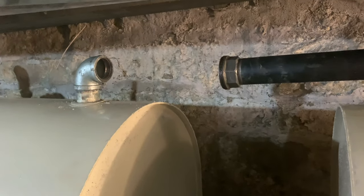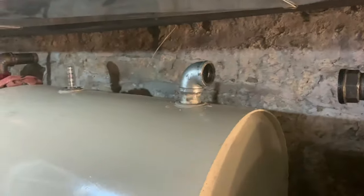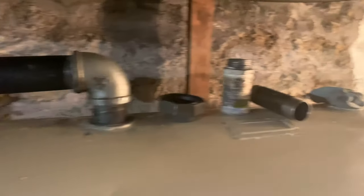Crossover can stay bigger. Now, what we're having problems with is I think these bungs, which are the holes down there on our crossovers, were kind of V'd, they were bent. So I'm going to make this side here longer than this side here. And then hopefully that union is going to bring this side up and make this straight across. If not, we're going to have to eliminate both these tanks and get new tanks. I don't want to go there.